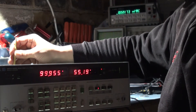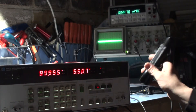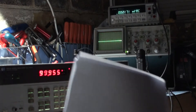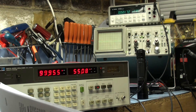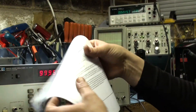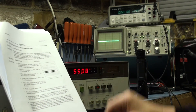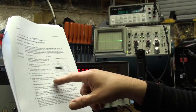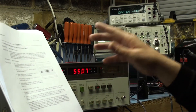OK, I think that's about the best we're going to get there. I think that concludes the entire calibration of this Hewlett-Packard Audio Analyzer. There are a few things in there that aren't actually that clear, specifically where it tells you to connect it to an output jack. Part of the final setting out procedure is to connect the DC voltmeter to the output jack — but it doesn't tell you which output jack. I think it is the high output jack, but you need to be absolutely sure. I certainly didn't seem to get any adjustment when I was doing that, so I need to verify that.